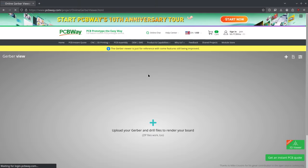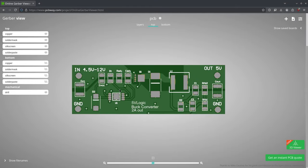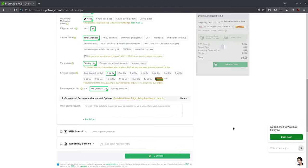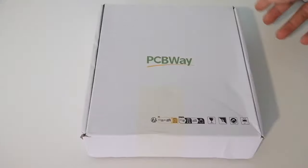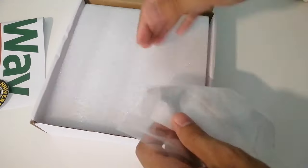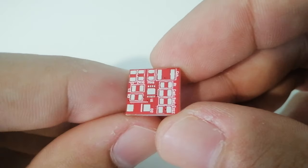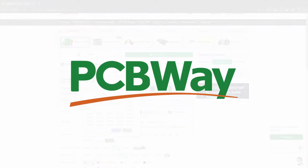The last thing I do before ordering a PCB is always check it with the online Gerber file viewer, which is a free tool provided by today's sponsor, PCBway. After that I place the orders — I'm going to make these red this time just to switch things up. It's just $6.50 for five PCBs, so great prices. After confirming the order I got the package in the mail just a few days later. The copper traces are looking really good, with 0.2mm spacing between pads that I was worried about — apparently not a problem.